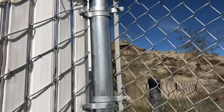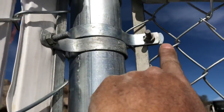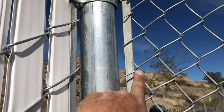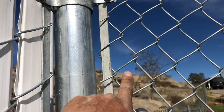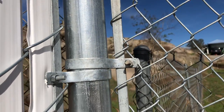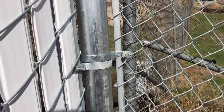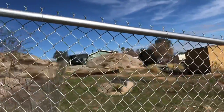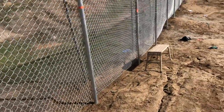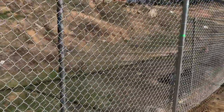And that technique is basically, if you have a needle or a picket coming down, when that hits that post, make the cut. And then you jump into the next needle over. And it'll guide you down to where, when it touches, go ahead and make the next cut. And then you jump over to the next needle where it would be coming down. And when it touches the pole, make a cut. And it's a really good indicator to tell where you need to make the cut. Every time you jump over to the next picket, it'll lead you into the post, so then you make that cut. Put all your spot ties on and get it dressed out as nice as you can and pull a little tension on it. And then when you stretch it, you're going to have a really nice time tying this off and having your fabric look really nice.